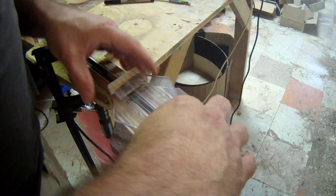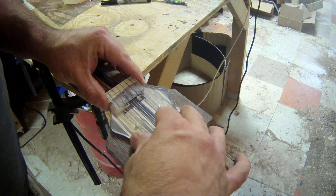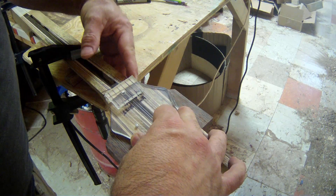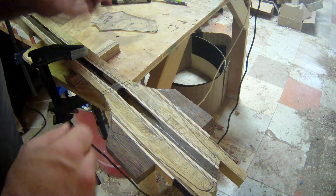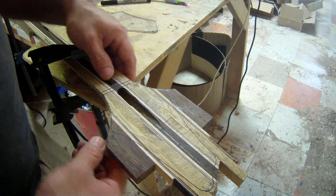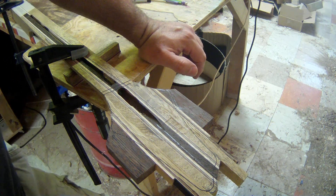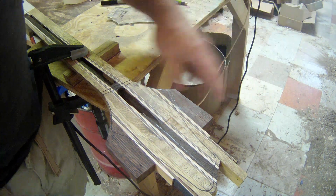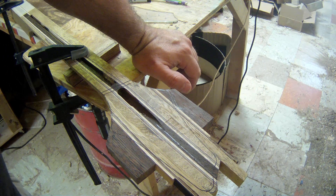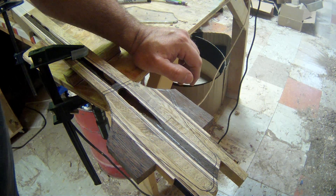Then I looked at and reread our centerline, and I looked at mostly where the slope is going to come off of the nut — because it needs to be behind the nut really, so that kind of dictates this slope as well. It's bigger than I want really, but it's kind of hard to avoid that unless we offset it, and I don't want to do that — I like symmetrical ears specifically so it'll hang right. I think this is our shape now finally, so we can start working it.